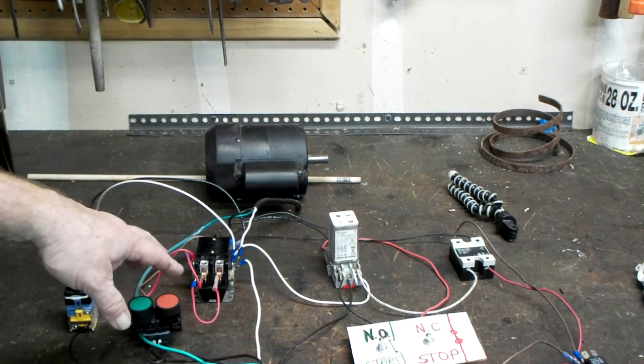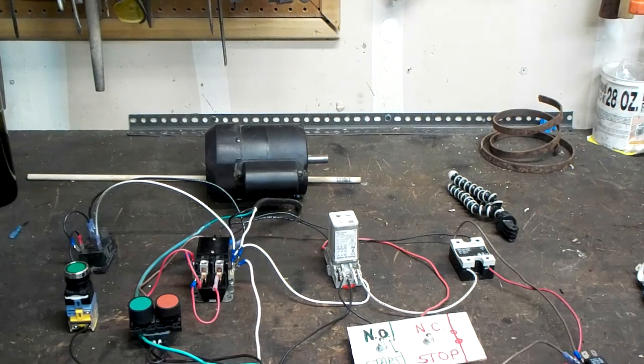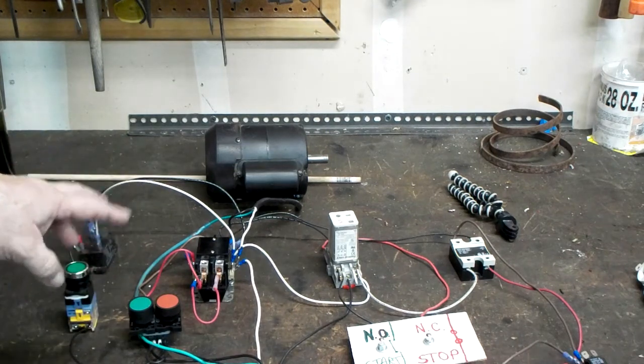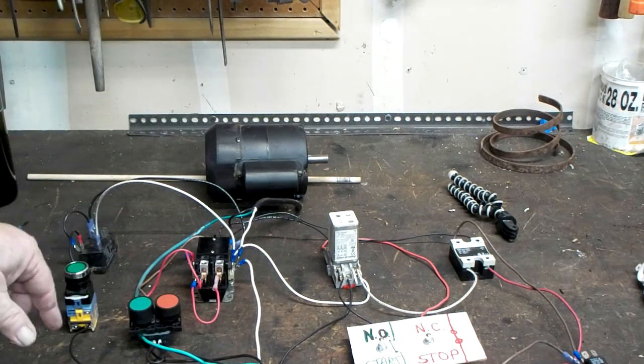The second one here, this is very common, what you might see. This is a relay that might be in an air conditioning unit, but it's suitable for starting motors up to about 40 amps. So it's a real common, real sturdy relay, definite purpose. See them all the time.